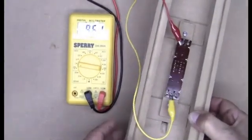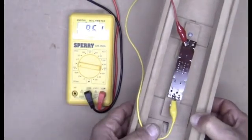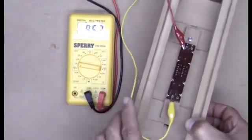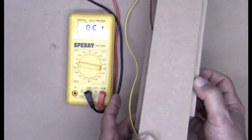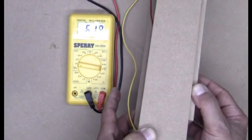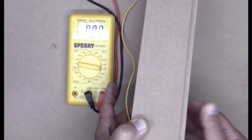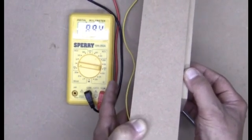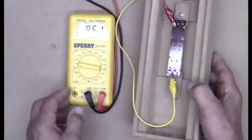We have our movement. I've set up a meter and it's reading 96.1, which is about 100K — exactly what this potentiometer should be. Now I'll slide the slider, and you'll notice the reading is changing: it's down to 5, 2, down to 0 as I reach the other side, then it goes back up as I slide back, returning to 96. Our slider is working perfectly.